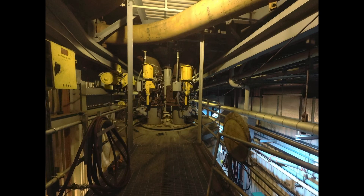This is the top of the pulverizer. These are the BSO — burner shutoff valves. These are the coal ducts; four coal ducts come out of each pulverizer heading to one deck of burners. The coal comes down the center from the feeder, which sits above here. There's a coal valve up here — the feeder outlet valve. Down here is the temperature probe.